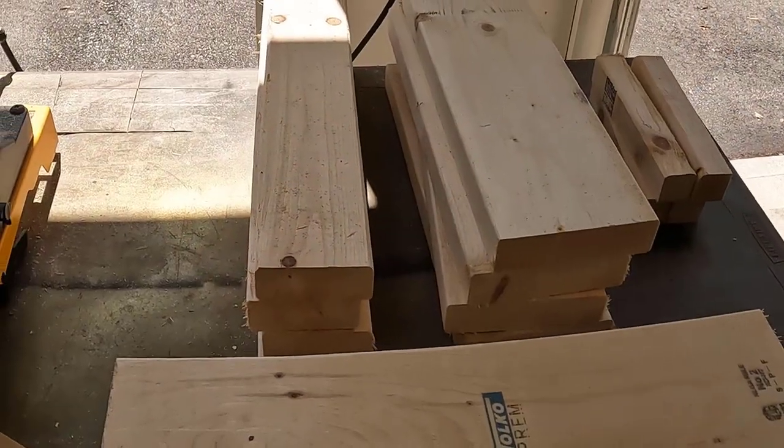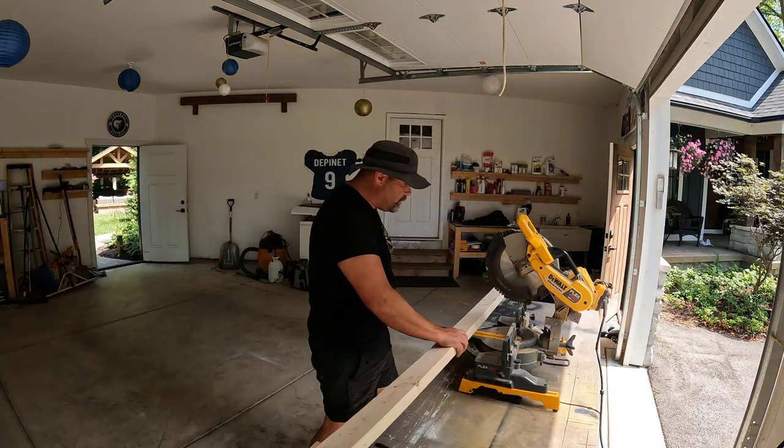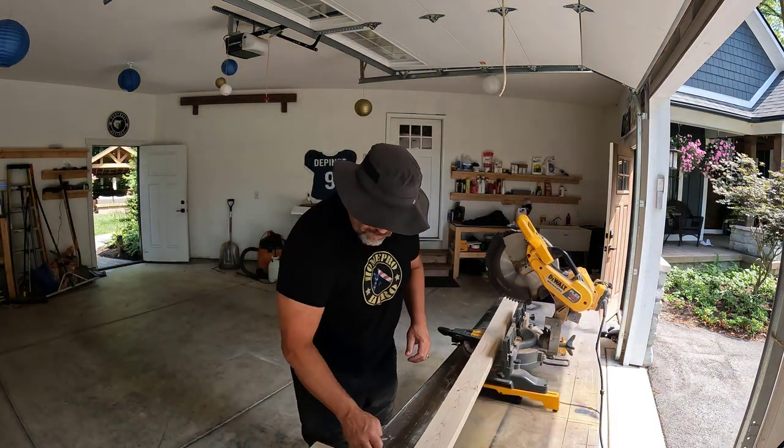All the measurements are in the description, that way you know exactly what lengths I'm using. But right now I'm going to cut four legs. The legs will be 2x4 material. They'll be 20.5 inches. I'll put a 1.5 inch topper on top of the table, so that gives me a total height of 22 inches. The width will be 16 wide. The length will be 20 inches deep. So let's get to work, start cutting this stuff.